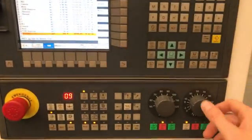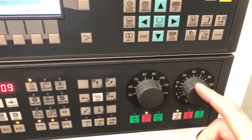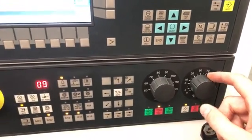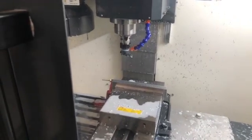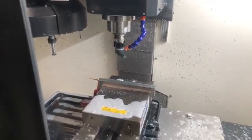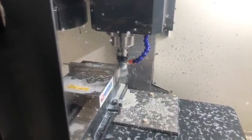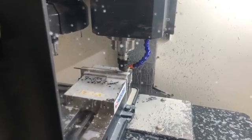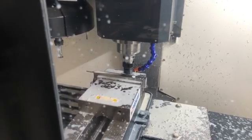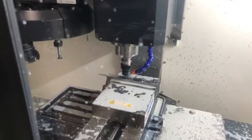I've just been playing with the feed override to get the desired finish, and I ended up finding that 80 was a nice finish for me. We'll run that — it's just going to clean it up and then do the pass. This is the cleanup pass. Turn the coolant off — so that's just getting rid of the existing texture that I had on there.